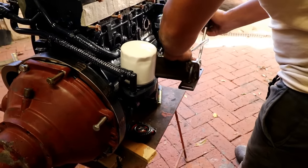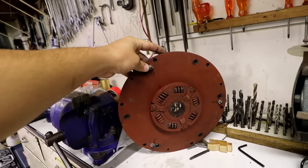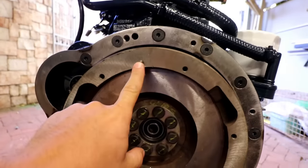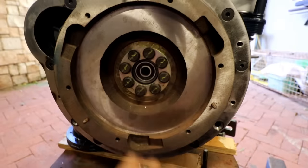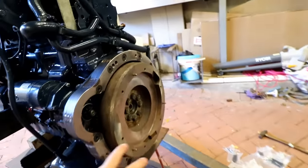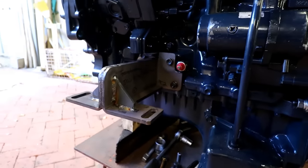We had to ensure everything still fit after all the welding. Here we've got the torque transfer plate — those are dowel lineups, we put a bolt and nut on it so it holds perfectly secure. We've got a guide plate that we're going to drill all our holes through, which line up on the flywheel. We'll bolt the plate onto the flywheel, and the adapter plate is already on with the starter motor already mounted. We just need to get the transfer plate on, put the bell housing on and double check, then send everything for sandblasting and coating. The engine mounts are already on and also going to get coated.